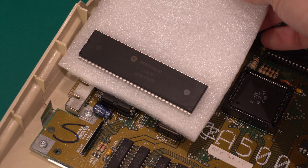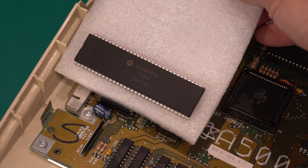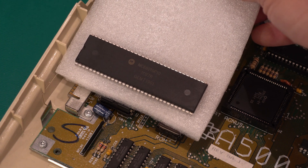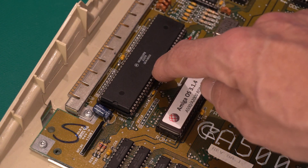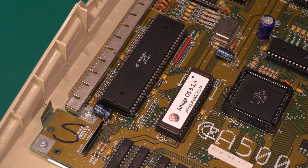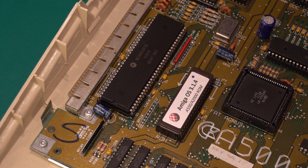So now we're going to take out the real 68010 and replace it with the not-real 68010. You'll see what I mean because we already know the silk-screening is extremely suspect. I did order five of these, but as you'll see in a moment, hopefully it wasn't a complete waste of money. I'll remove this and install that thing over there. Just like magic it has been installed, so I'll turn on the power and we'll see what SysInfo has to report.